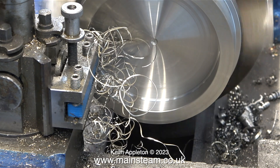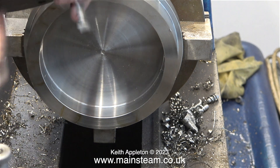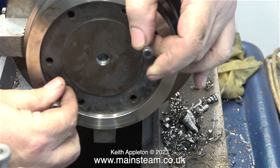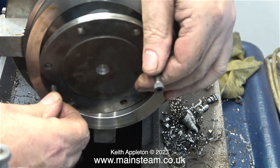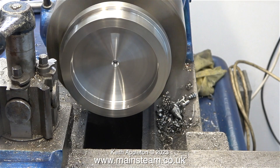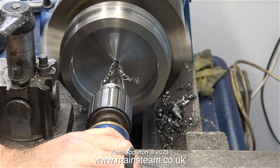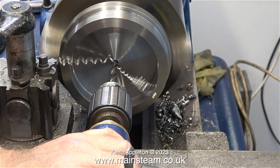It was at this point that I decided to enlarge the diameter of the hole — making plenty of swarf in the process. Now it's time for a test fit. That's better — it's not an interference fit, it's more of a rattle fit, because when I have the cylinder cover bolted to the cylinder and I fit this ornamental cover, I do not want it to stick to the cylinder. The stainless steel cover will be held to the main cylinder using a 5/16th of an inch diameter bolt.